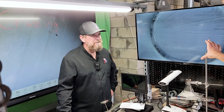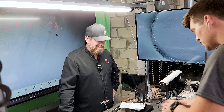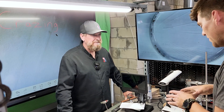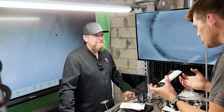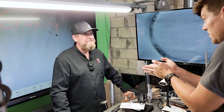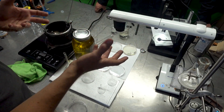The oil has now completely impregnated the plastic right on the surface — this PVC clear plastic — causing it to swell and creating these lines we can distinctly see. Over time, as it starts to create this disassociation of bonds on a molecular level, it's going to go deeper and deeper, creating separation that will eventually cause the plastic to crack and completely separate.